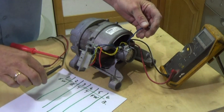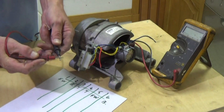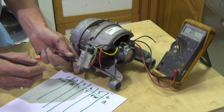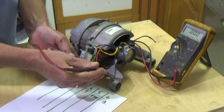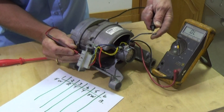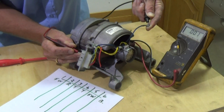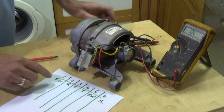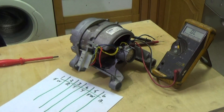Although we've already checked the wiring by colour, I'm going to use a multimeter to show you how to chase them through with it. Set the meter onto continuity and then we'll work out the configuration. As you can see, the red wire is definitely a brush and it goes on number six. Number two is a brush on the blue wire. The two yellow ones are on number three and four, and number five and number one are definitely the field windings.